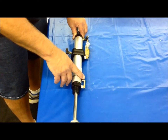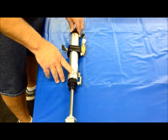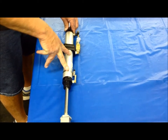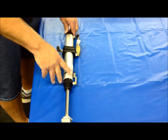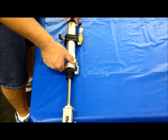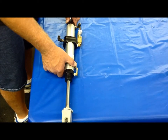We have our reed switch. Now, depending on whether we're a driver's side pod or passenger side pod entrance wheel cylinder, we will have one reed switch or two. But with one reed switch, the primary purpose of it is to read the outbound motion to let the system know that the brushes are out in the way. That would be our outbound reed switch.